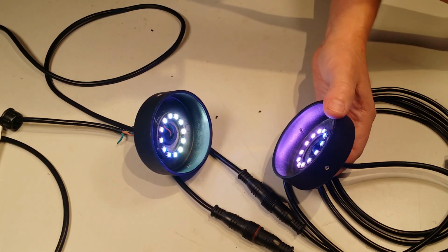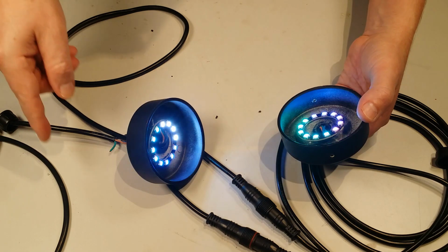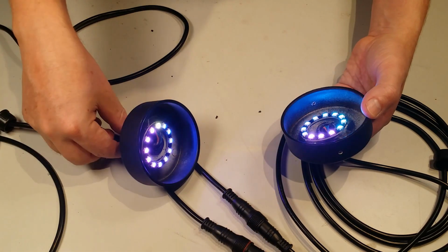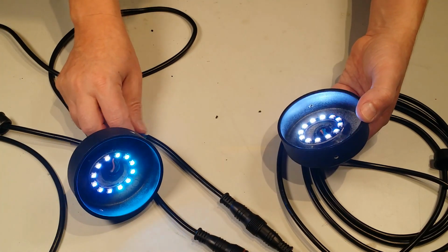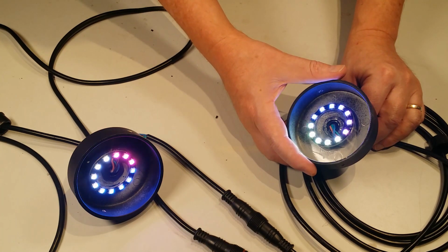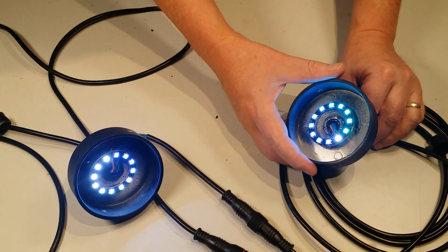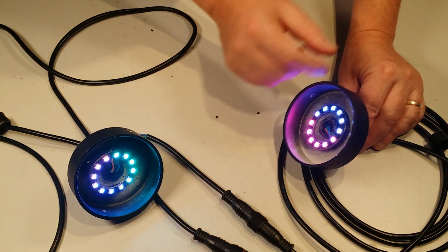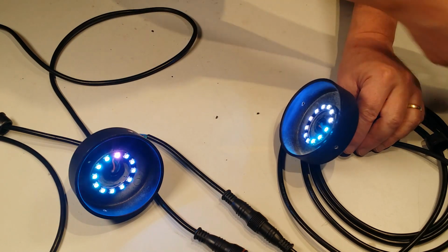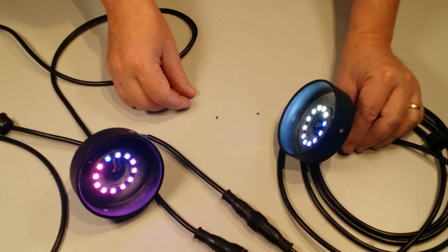So overall the data seems to be going quite well from one pixel ring to the next, down about 4 metres of cable in total, data wise. Power's only having to go down 2 metres of cable, because it's joined at the centre piece, which will be at the pixel distributor I'll have at the centre of the tree, and then these will just radiate out and I can hang them wherever. I'll make them all 2 metres or thereabouts, and I can hang them underneath the branches and let them sway in the wind. They looked quite good last year with the 3 LED versions, except that had the program built onto it. This way I'll be able to control them centrally, so that and the new meteor tubes will make a bit of difference. I think it'll look quite nice.